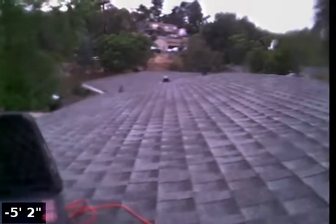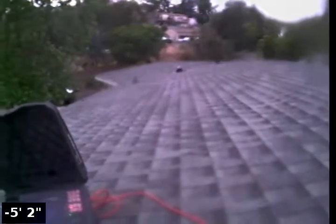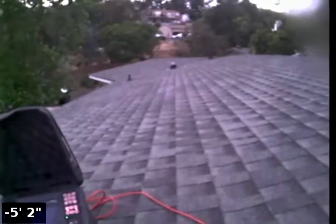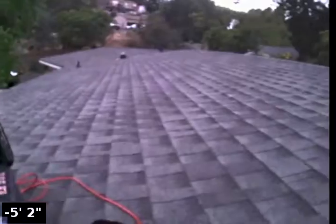Again, we have those two cleanouts marked, so that if somebody did flush something down they shouldn't and clogged up the main, they'd either have to pull the toilet or go from the roof vent. Otherwise, in the future, they may need to expose those two cleanouts that we've marked for the property. So that concludes this recording.